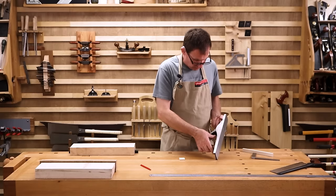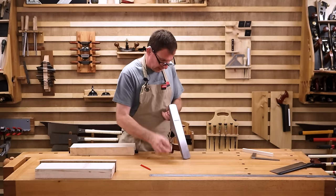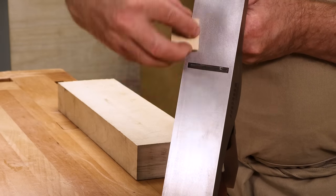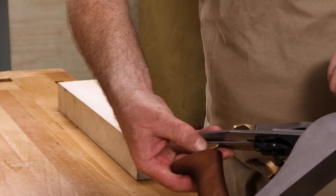So nothing cutting, I wind the blade forward a little bit. So this is giving me that quick setup just to see what's happening. So the scrap block, better to work with. Now I'm getting a cut on the left hand side, not on the right. So we're going to swing our lateral lever, just bring that round over just a tiny bit.